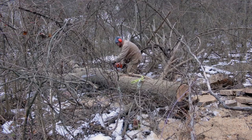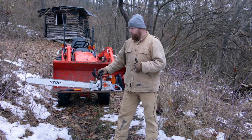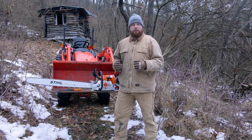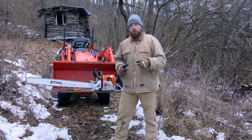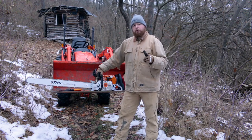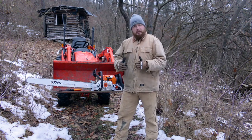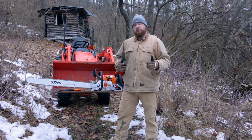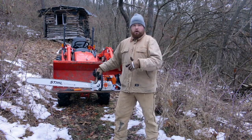A few hours later — we finally got through our three tanks of fuel. It took quite a few trees to get through it. The more difficult part is really just training your brain to think about how you're cutting into the wood. For the first tank we did three quarter throttle through all the wood, which was a little difficult to keep at that sweet spot without revving too high. For the second and third tanks we went full throttle under load. The most important thing was easing into the cut at the start and not free-spinning the chain on the way out — it's more mental than anything, just being mindful of how you're using the saw during the break-in period.